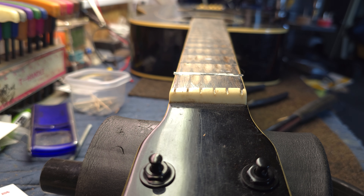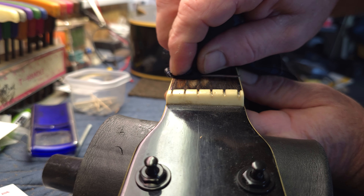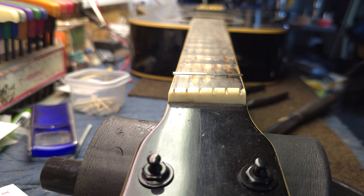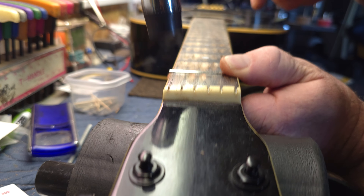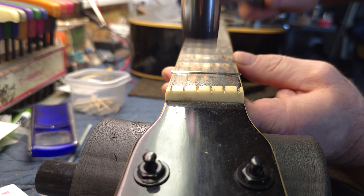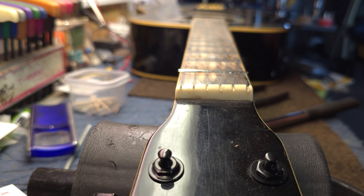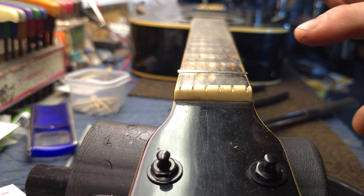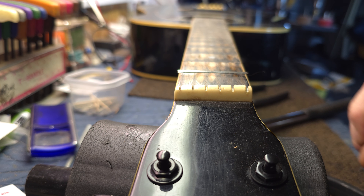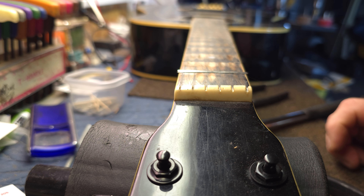Take a damp cloth and wipe off that excess glue. The cleanup is really nice when you use fish glue or wood glue. I'm going to tap this side one more time. If you see a little glue spill out, you know it's not down tight — that's a good gauge. After you drive it in, go back over it with your fret hammer quickly. If glue comes out on the side of the fret wire, it wasn't quite down all the way. When you glue these, they're kind of there to stay.